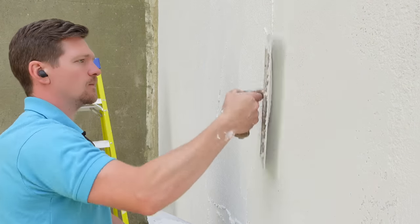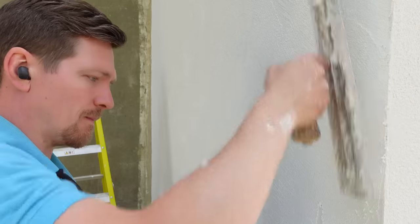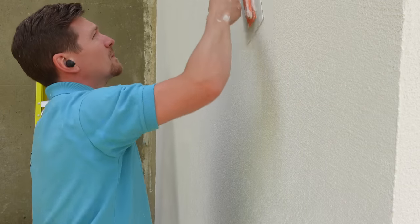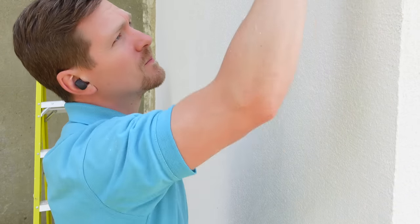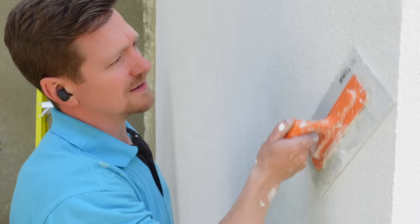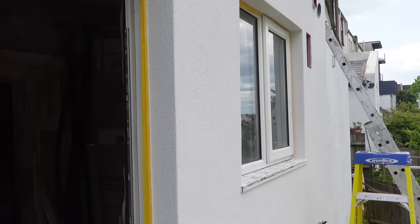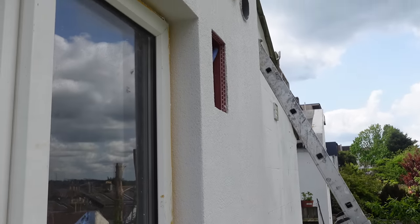I often work alone — if you've seen my videos, you know that. It is possible, just working one-meter spans across, making sure once you've worked into that area you float back on yourself. Working in smaller sections, it is doable and easy enough to achieve. We're just floating in small circles, closing the pores up, getting rid of drag marks, working towards the reveals and outer edges. If your backing's done and your walls are clean, you get really nice results — a clean finish with colour in the product, so no need for painting, giving a versatile, flexible, non-cracking rendering system.